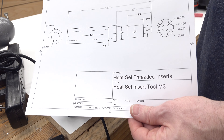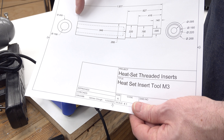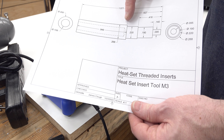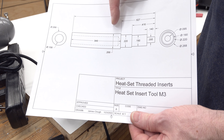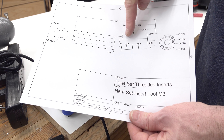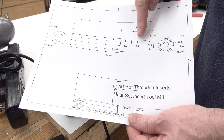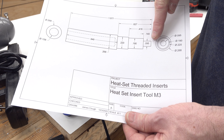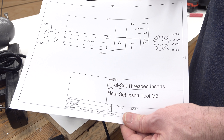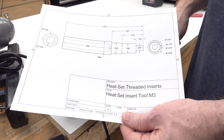We could try to find a tip that would be suitable for putting these little threaded inserts into plastic parts, or we could just go ahead and make one. I've got some brass, and the geometry of this is simple enough, so it should be really easy to just pop over on the lathe and make a tip that's purpose-built for putting in these inserts. The back end is just the geometry for the tip — we've got a hole drilled in the back, a controlled shoulder length and diameter so that it can clamp into the soldering iron handle, and up front we've got the right diameter to push on this particular insert and the right diameter tip to go through the threaded hole in the insert to locate it.